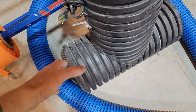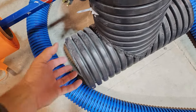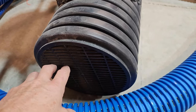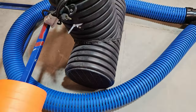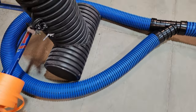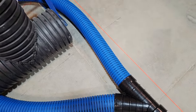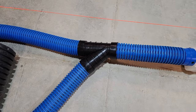You're going to dig out the dirt, go 30 inches deep, and backfill with stone — it needs to be permeable so water can run right through it. Don't use pea stone or fine stone because you don't want your pump sucking up stone chips. Use inch-and-a-half round rock around the sump pump system; minimum use one-inch rock, and try to go for something that's not crushed and doesn't have fines. You have perforated pipe with holes 360 degrees — top, bottom, and sides — going all the way around the unit, with just a Y fitting.